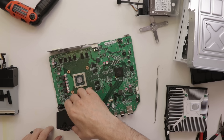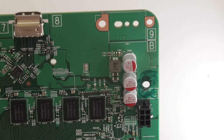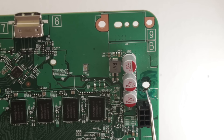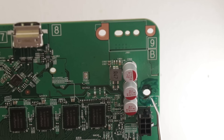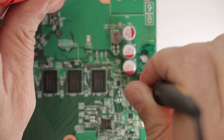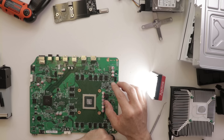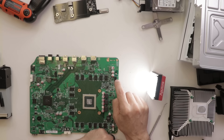Definitely have a problem on the power supply there. Actually, looking closer, I can see more burning, more shorted spots — and I know I had that completely cleaned before. I thought the damage was from someone pushing down on the power supply and creating a short, but it seems like there's something else going on between the layers. The short is back. I guess the only thing we can do is dig it out further and see what we find.